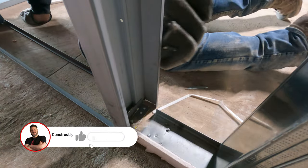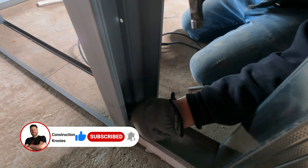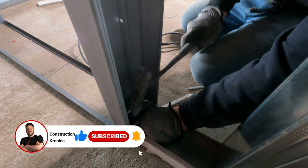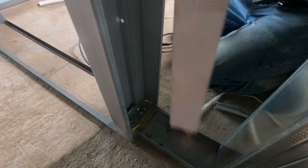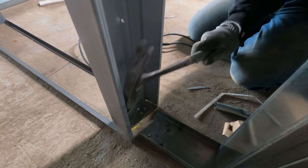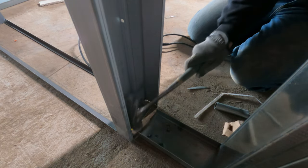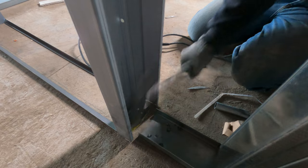I've got that little piece of conduit cut to about six inches, with one end hammered down so I can get into tight places — makes it easy to hammer the pin bolt all the way in. In this case, you set one pin on each side of the door frame, then go back and drill in the other two. One pin on each side — that's a quarter-inch pin bolt with a quarter-inch drill bit using the hammer drill.